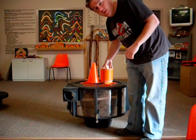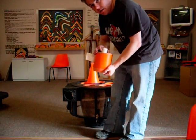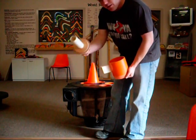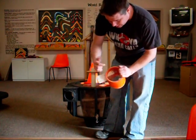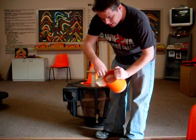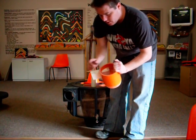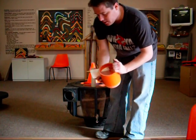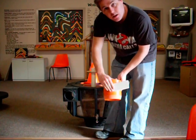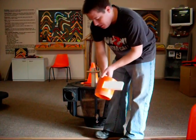To give a better idea of the cyclones on the inside, here's one of my test cyclones I used when experimenting. You've got your pipe going into the centre of the cyclone. There's a clear ramp directing the air from the inlet tube around and below the inlet tube, so the air doesn't crash into it and cause turbulence and stir the dust up as it goes around. The inlet tube goes in on a bit of an angle, which also helps create a smoother air path.